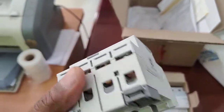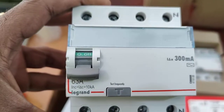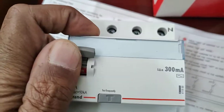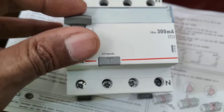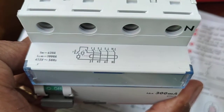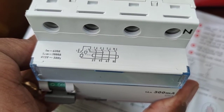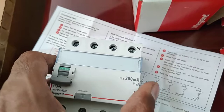Today I will give education about the RCCB. This is one made by Legrand, recently used. It has a 300 milliamp current rating and 63 amps current rating. It has on and off indication, and it supports up to 10 kA fault level. The model number is mentioned here. It also has wiring detail — terminal numbers one, two, three, four, five, six and N. The neutral terminal is to be used here.